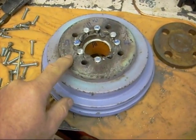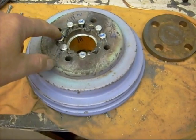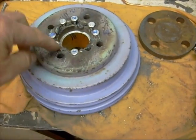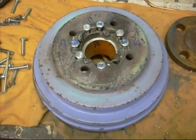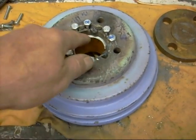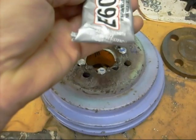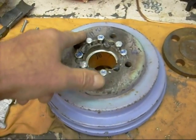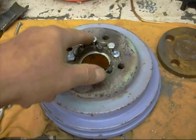We've put this pulley onto the blank and onto the Lovejoy coupling. I drilled holes through the pulley and the blank, then drilled holes into the Lovejoy coupling and threaded them out. These guys are all tied down nice and tight. This one's totally misaligned so that doesn't get to go on. Before I put it together permanently, I'll use some lock washers and also this E6000 industrial strength adhesive. I'll put that between the Lovejoy coupling and the blank. The blank is welded onto the pulley so that part's good, but I think this is kind of an alloy so I'm not going to try to weld it — I'm going to glue it and then screw it.